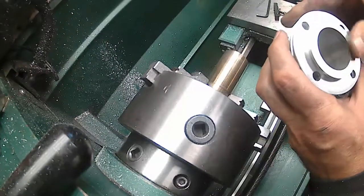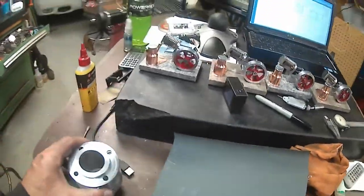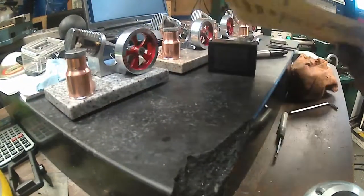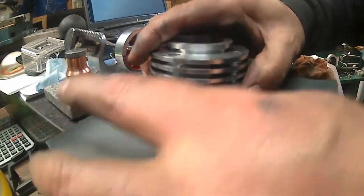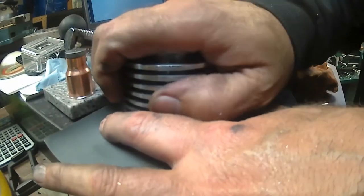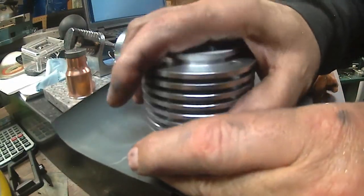So, it don't look too bad. Alright, well, I think that's going to be it for today. Where's my little old pad, there it is. If I take this paper and lay it on the surface plate, and then take that scarred surface and lay it on there, and give her a few strokes here, I'll take the high spots off of it anyway, and it'll still seal all the way around, so it ain't gonna hurt nothing. There'll be a gasket material in there anyway.